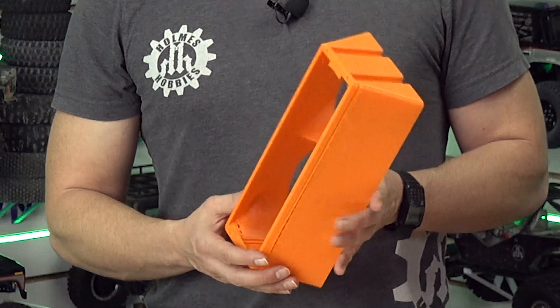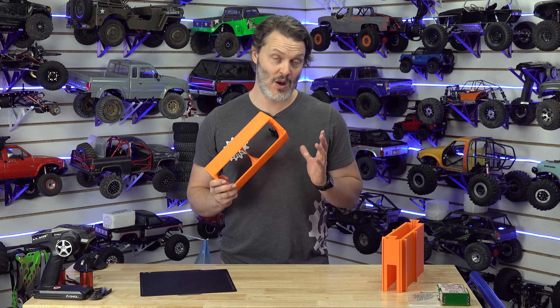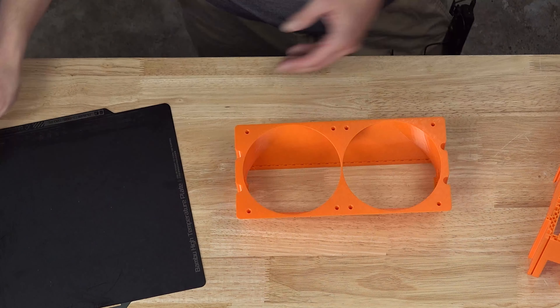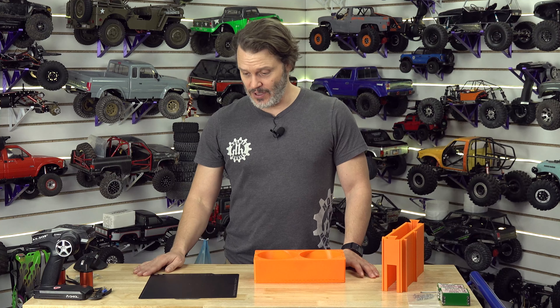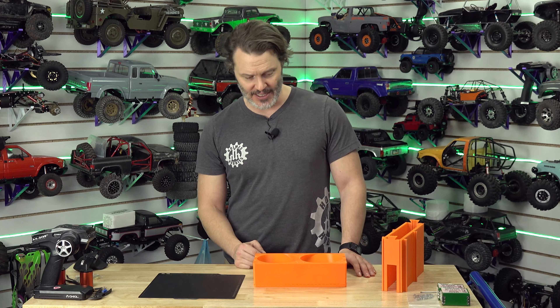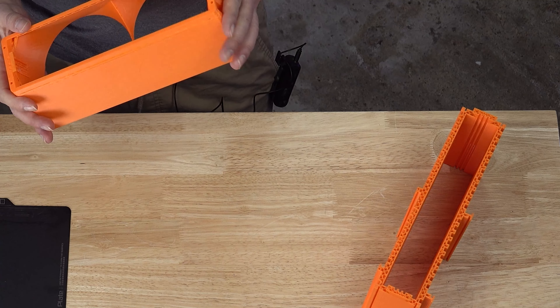As you can also see, there are layer shifts. I thought that because of the speed of the printer we had encoders on the back so it wouldn't be able to skip — but we're having skipping issues and I have no clue what's causing this. The belt tension is absolutely fine, there are no contaminants on the rails, and it's only happening in one direction — forwards to back, which I think is Y. I printed the exact same file twice: the first one had no problem, the second one did this, which makes it pretty much unusable.